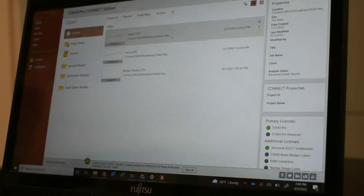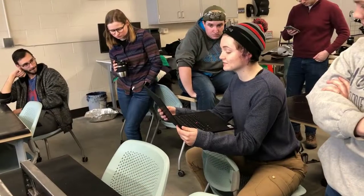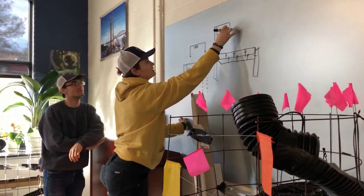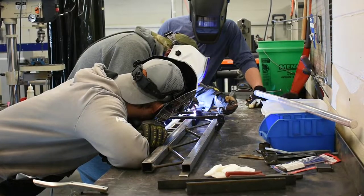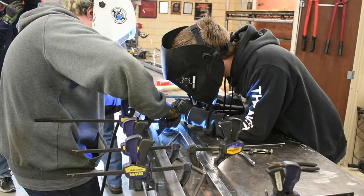The first step to making really any bridge is to come up with a design for the bridge. Our captain, Brianna Newman, did a lot of the design of the bridge as well as getting all of our other members involved. We designed the bridge using Bentley's STAAD program, where you can basically model the bridge out of a bunch of beams and nodes. I modeled the legs and we passed that test. Every year we start with a general design meeting — I go to our team, show them what the rules look like, and we brainstorm ideas. Then from there I start putting things into STAAD. The STAAD process is usually pretty iterative, changing the properties of the beams built out of different thicknesses and shapes of materials. This year we went with a square bridge using square tubing. I wanted to make it easier to fabricate rather than using round tubes, which we've used in the past. We use 4130 chromoly steel, which is a very high strength, low weight type of steel. For the use of our bridge, it works extremely well.